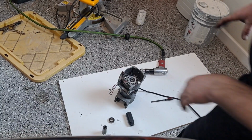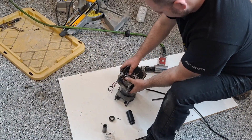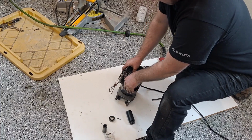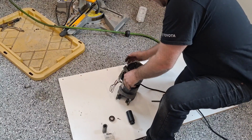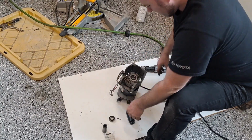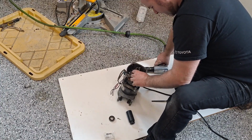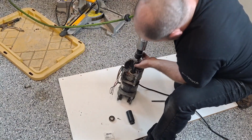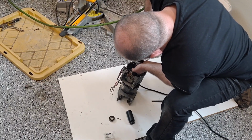All right, here we go. Because I'm banging on the floor, and I like this floor, it's brand new, it's a lot of money, I put a little board down. It's going to be better for the compressor housing on the bottom. Make sure it sits nice and flat. It's actually sitting on the shaft a little bit. And then it's also going to be better for the floor. So here's the jam. Ready? This is sitting on the inner race. I'm going to make sure I hold it straight and give it a little correction if needed. You could do this with a hammer if you had to.